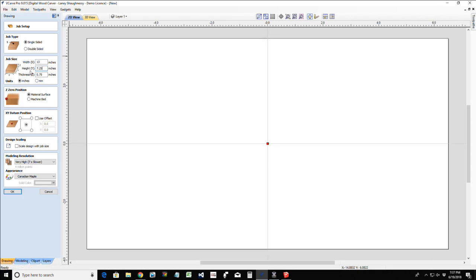7.25 inches wide by, and again, this is up to you whether you use 1/2 inch material or 3/4 inch. Sometimes 3/4 inch can be a little bulky looking, right? 1/2 inch should give a nice little delicate look. So I personally am going to lay this out as a 1/2 inch piece of material. But if you have a 1x8, which is a 7.25 inch board that's 3/4 inches, and you're like, man, I don't want to mill this down or plane this down and lose that 1/4 inch material, then just make it out of 3/4 inch material, right? Whatever you want to do.